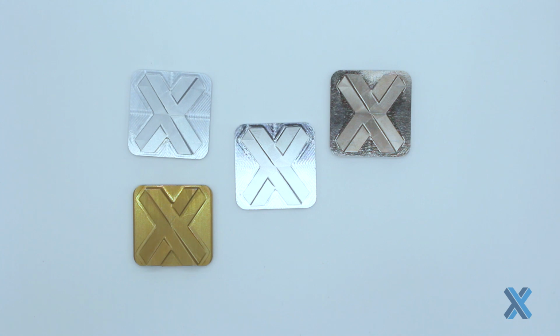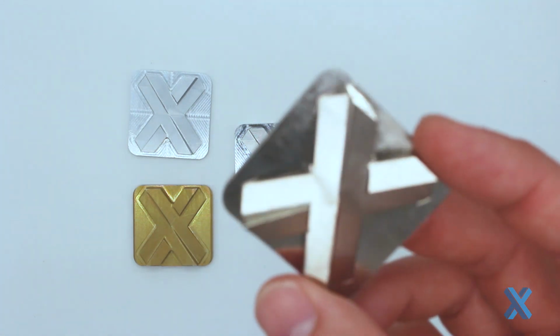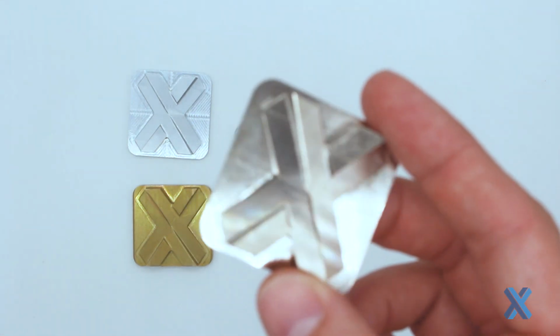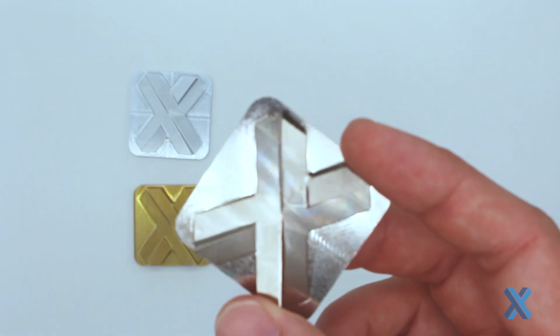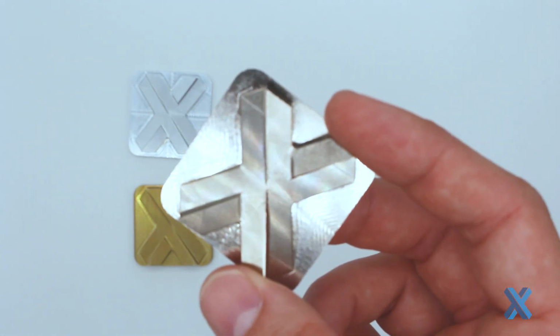So metal plate is essentially taking a material that is different than the base material. So in this case, aluminum, but this could be anything conductive: steels, coppers, brass. And in this case, I have this aluminum part that is nickel plated. Our most common platings are things like electroless nickel plating, as well as we do some precious metals like gold and silver plating, particularly for conductive surfaces. A lot of times we see copper parts that are plated gold, for instance, to be a better conductor.